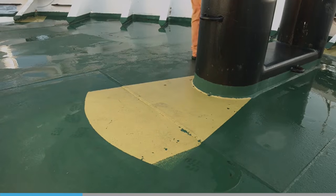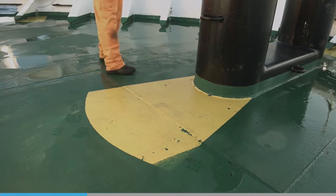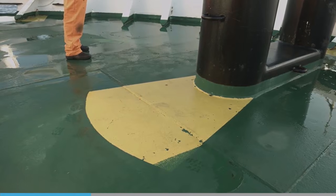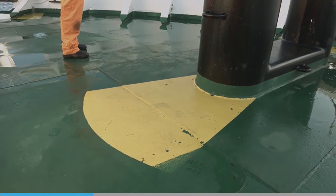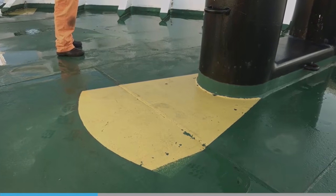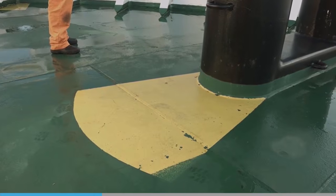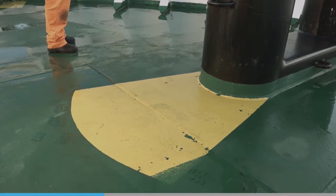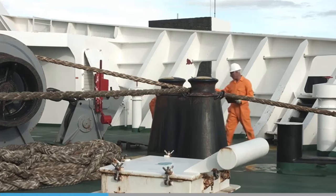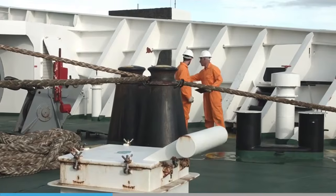Some vessels try to identify these hazardous areas by painting snapback zones on the deck, around posts, fair leads and winches. However, according to the UK Code of Safe Working Practices, the painting of snapback zones on mooring decks should be avoided because they may give a false sense of security. As snapback zones are very difficult to forecast accurately, you should consider the whole of the deck dangerous.